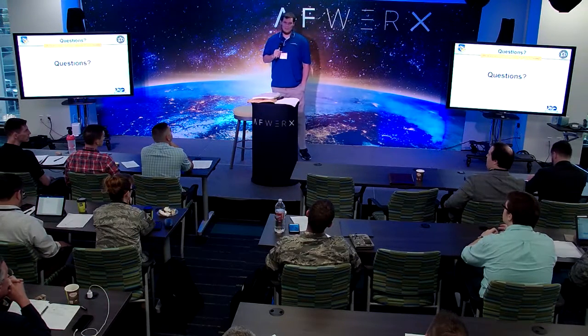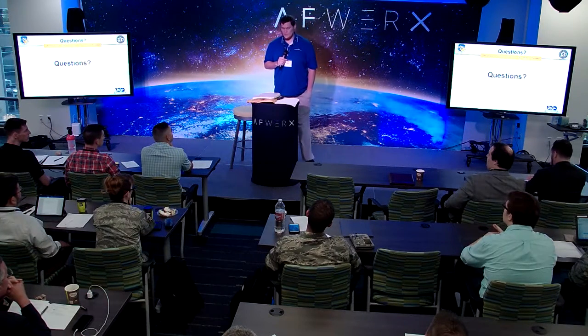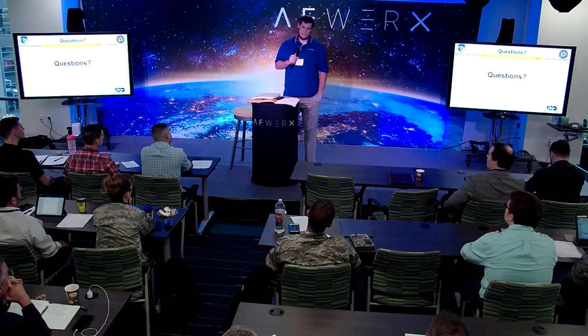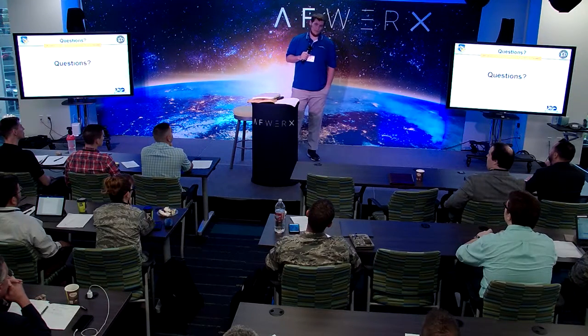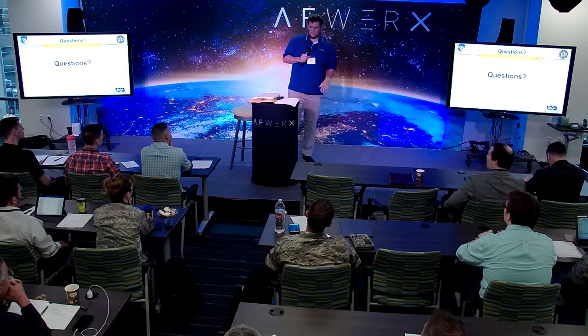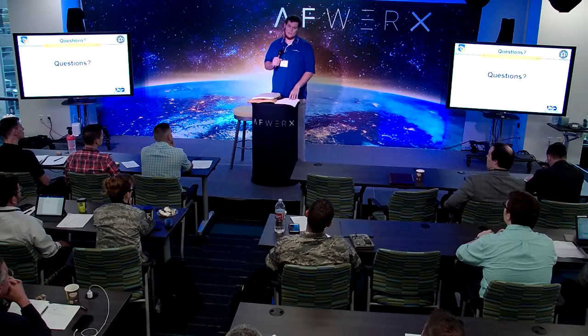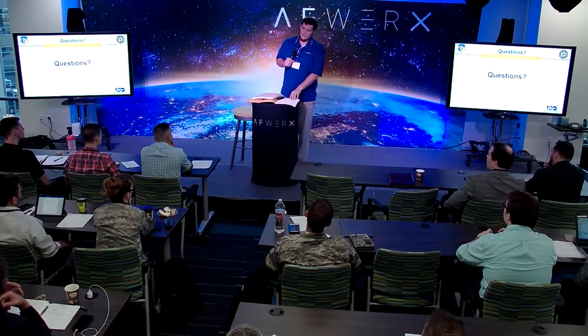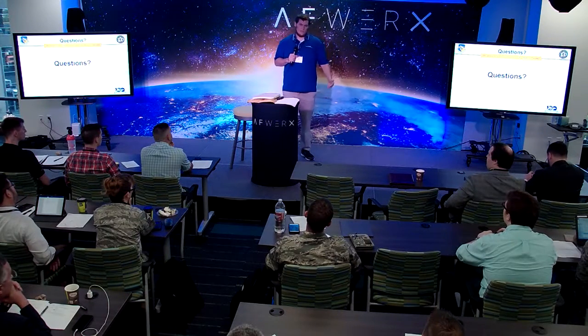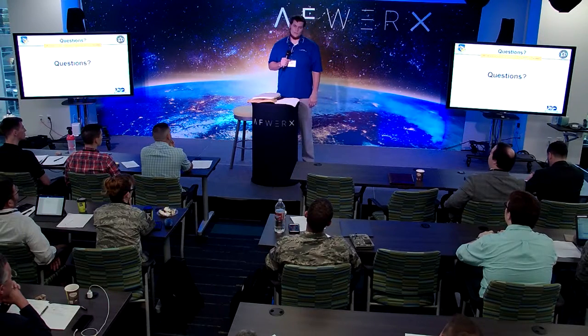That's tough to answer. That's really my day job, materials and manufacturing. That's kind of my background. When you start talking about how long it takes to make a mass amount of stuff, it really depends on what your cutoff level is. If you're making 100 plates, you're going to buy a shaker table and pay some guys to come in and set the balls. If you're going to make 10,000 plates, you're going to pay a guy to write AI software to scan the plates to see if there are any gaps in the balls. So there are different cutoff levels depending on your scalability. At 500 plates, you're still probably just looking at manual labor. I would say it'd be 4 or 5 man hours a plate. It would scale up depending on how many people you hire and how many foam machines you want to buy. Not long.